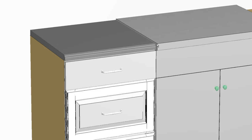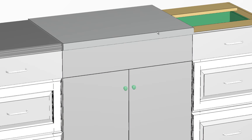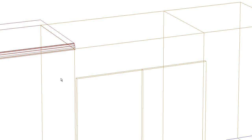Now they're overlaying this by 1.5 inches, so on the sink cabinet, it's coming out from the face of the cabinet by 1.5 inches. Most granite countertop companies will have their granite stick out proud by 1 inch, so that'll leave about 1/2 inch up here, and that'll look just perfect. Actually, it'll be running and dying off right into it, so you don't have any funky joints going on. Same idea over here. You just run your countertop right into it, and it'll look real nice.